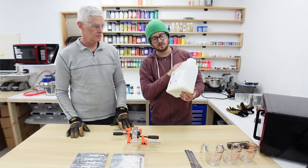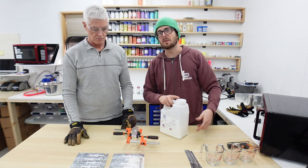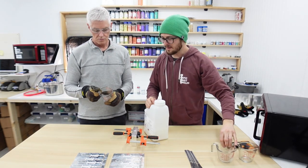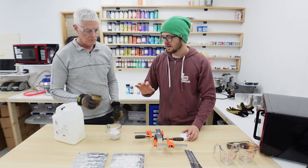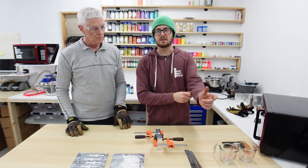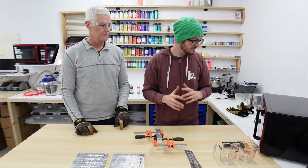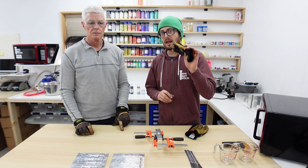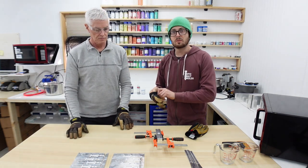Shake up your plastisol — this is Bait Plastics 242, a medium blend ultra clear plastic. We shake it so we can throw it in the degasser. Use small Pyrex cups — these are one cup — and pour about half a cup since we're just shooting the tails. Throw the cold plastisol in the microwave for one minute. You want to heat it past 350 degrees — shoot for 360, 370, even 380. This is a good time to remember: wear eye protection, wear sleeves or at least gloves, and have adequate ventilation.